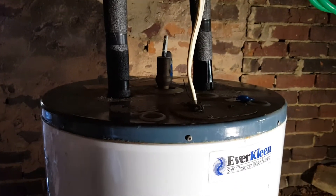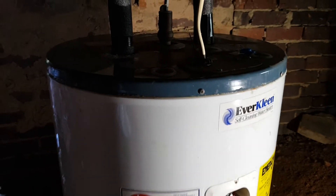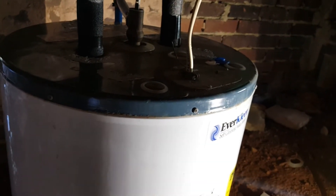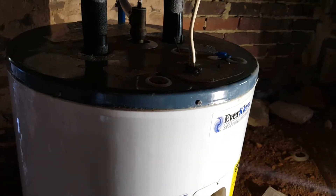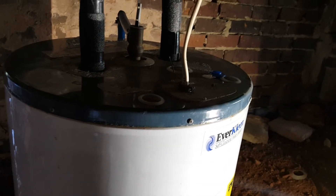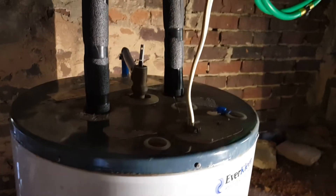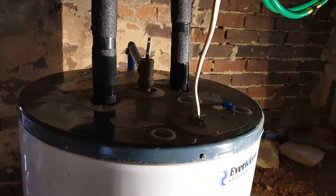What's left now is to turn on the breaker and test it. There is another important element in tank water heaters — the anode rod. The rod goes all the way inside and it prevents rust inside the tank. If you see a lot of rust in your tank water heater, it can be caused by deterioration of that rod. I suggest you change it as well. You can go to a plumbing supply store and tell them you need an anode rod — it's a pretty long rod, almost four feet.